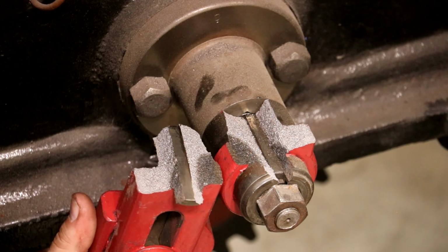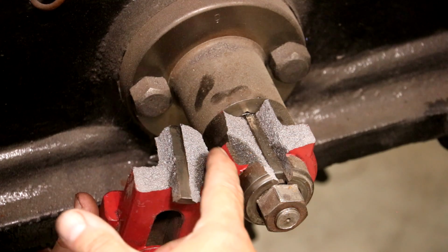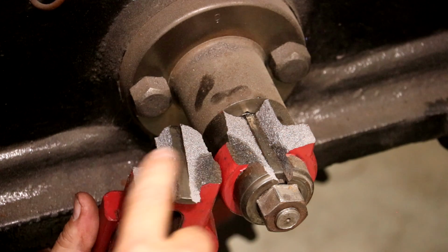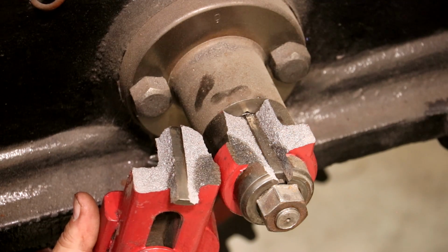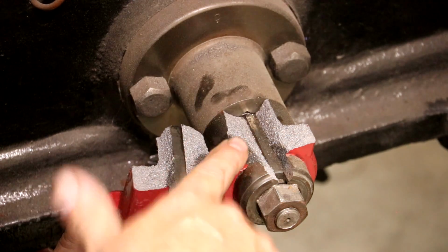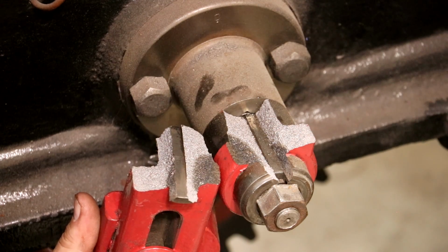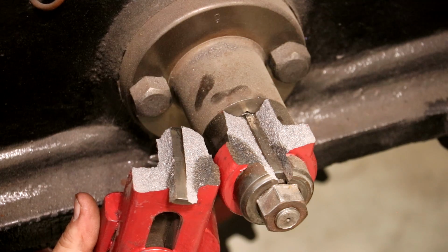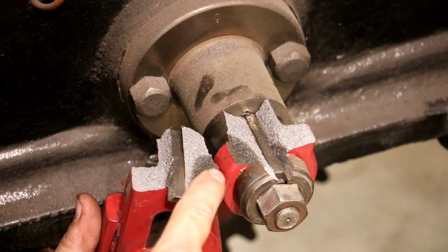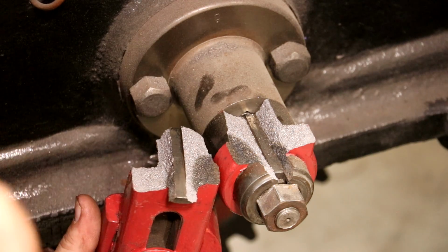It had a hairline fracture in there. That change in color was where the oil has absorbed up into this over time, and it's changed the color. So it was already partially broken, and in reality, this little mishap may be a blessing in disguise, because this was going to fail at some point in time. And by me going ahead and having it fail now, I realized that before I was into an important job where it would have gone and tripped and the table would have flown away on me potentially, and who knows what might have happened. So I'm going to have to fix this, and we'll do a video on fixing this.